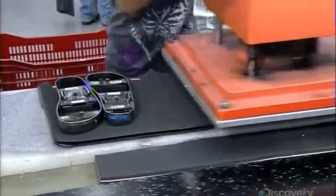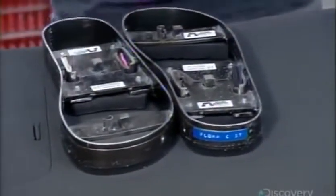They make the top soles from 8.5mm thick rubber sheets. A hydraulic press forces a sole-shaped die through the sheet, like a cookie cutter slicing through dough. The die also cuts a hole and 2 slits for attaching the uppers.